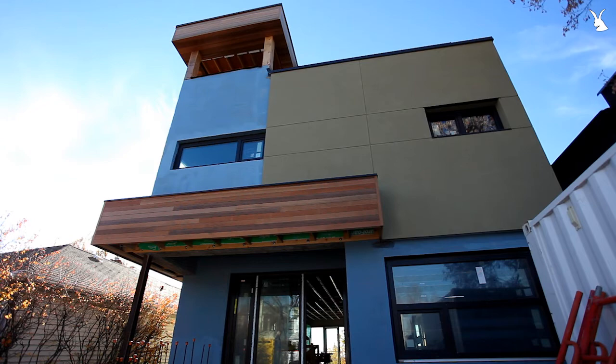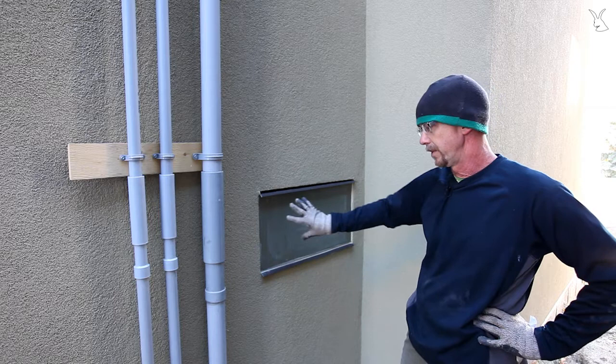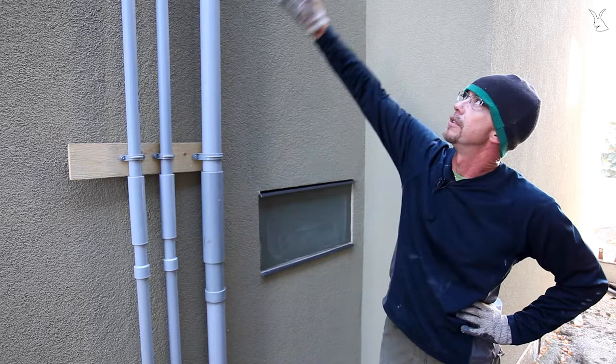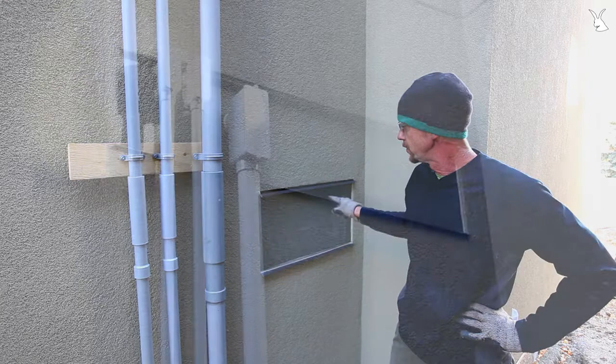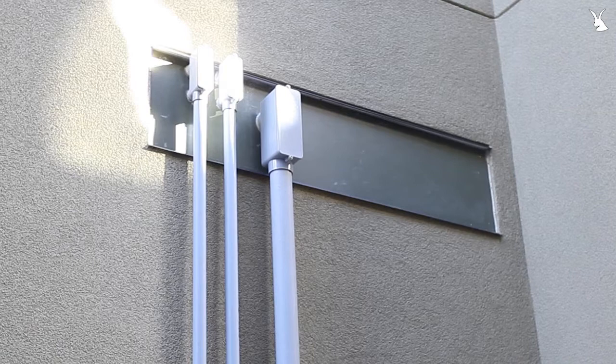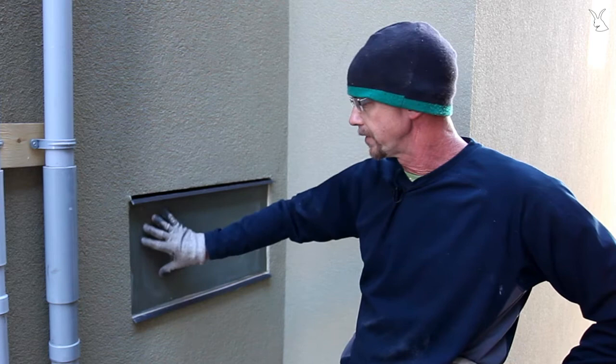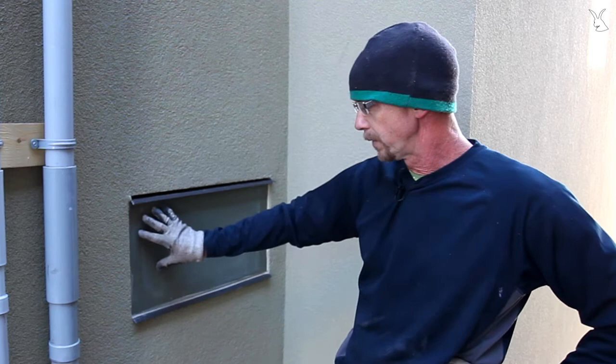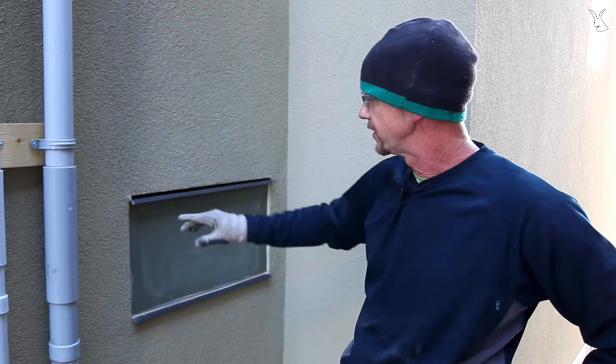These green panels were installed in conjunction with the stucco installer. Every building will have protrusions or penetrations — literally holes through the walls. We basically have three or four holes in each panel, so if you have a piece of conduit going into the stucco, you've got to seal that perfectly. This is Hardy Board, a cementious product. We can cut a nice round hole with a hole saw, put the conduit in, seal around it perfectly, and spray the inside with spray foam. Essentially, it's just one more layer of waterproofing — the panel won't leak because we've got flashing on top and all sides are sealed.